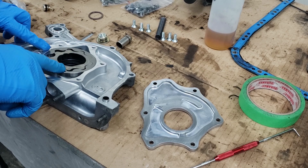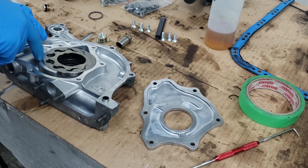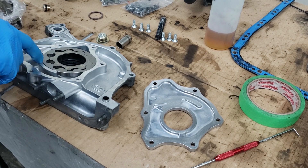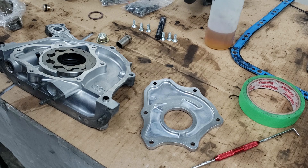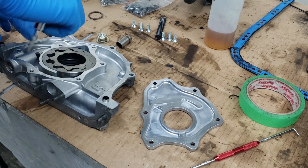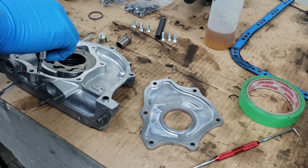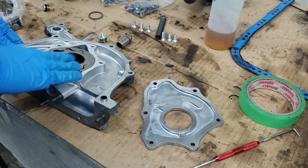The final test is the outer rotor clearance to the housing — we inspect this gap right here. At brand new, the clearance is between 0.004 and 0.007 of an inch. If you hit 0.008 or greater, it's no good and you have to replace the oil pump. Let's get out our feeler gauges at 0.004 and test this — yeah, it goes through. 0.005 is pretty tight. 0.006 — super tight, not even going through. So that's pretty much in brand new condition.